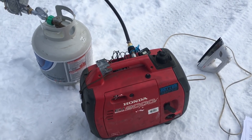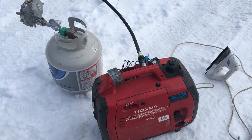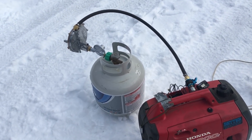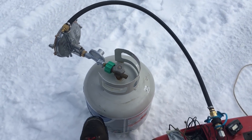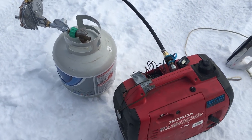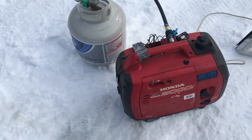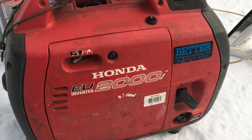You could get many deep freezers going because the running load of a deep freezer is not very much — it's just the surge load. This unit can do 2,000 watts for very brief periods and 1,500–1,800 continuous. It's like biking down a flat highway versus an eight-cylinder diesel truck carrying nothing. A big generator is nice briefly — like for a well pump — but you don't want to run it long or you'll rip through propane tanks.